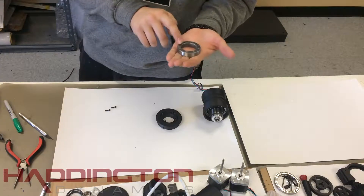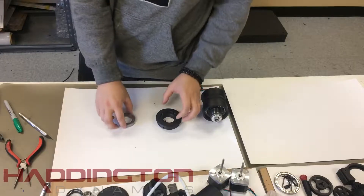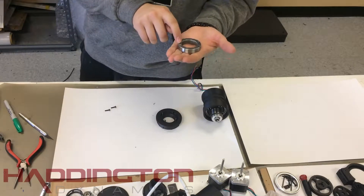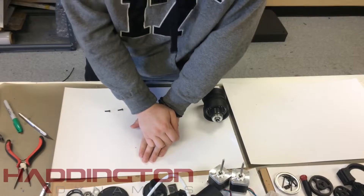Now, we're going to mount the stator gear onto the harmonic drive. Start by threading four M2 by 20mm bolts through the bottom into each of the poles. Just like before, look for the two threaded holes on the stator gear itself. They're only on one side, so match up the side with the threads against the two small holes on the bottom of the plastic piece. Once you've done this, press the stator into the mount.